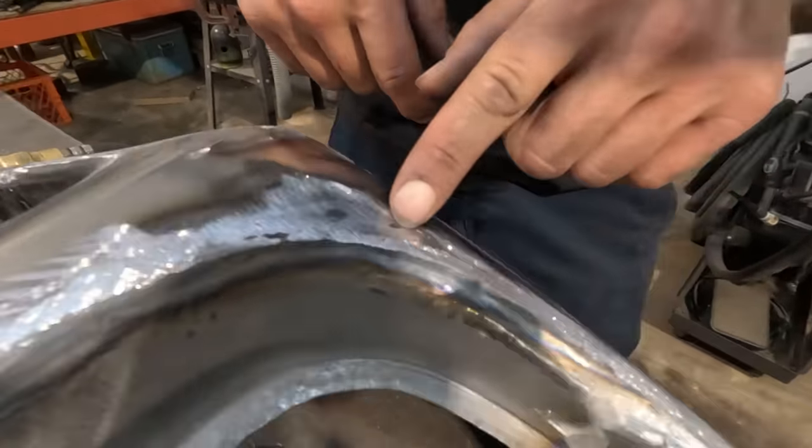Next up, we're gonna work on the top of this shell. I did grind each side of this peak, but we are going to want to make that perfect so that it doesn't look wavy to the eye, because right now it's not perfect. It's exactly flat on this side and flat on that side, but it's not filed to a centered peak. We're also going to address this side and this side. I'm just going to planish a little bit on this side and this side, just hammer on dolly, multiple small hits to smooth this out completely. And then we'll sand it, same here. And then we're going to put this edge into the center.